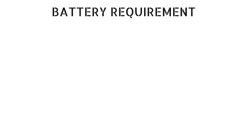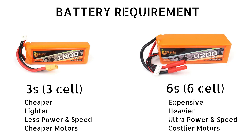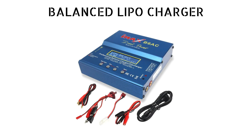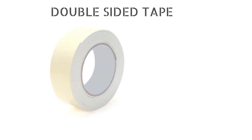Next we need a 3 to 6S LiPo battery to power our drone. It completely depends on your budget and requirement. On layman's terms, if you're using a 3S battery it will typically give you half the speed of what a 6S battery gives, but we'll be needing better motors for 6S and the price will be higher. Lastly, we'll be needing a balanced LiPo charger, cable ties, a soldering iron set, a screwdriver set, and a bit of double-sided tape.